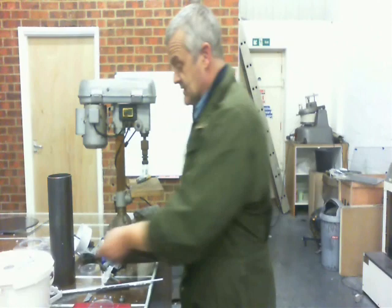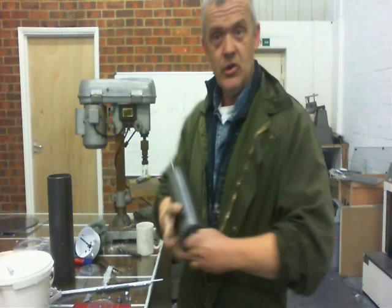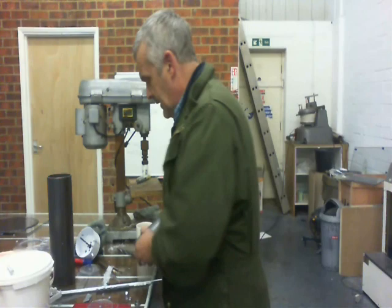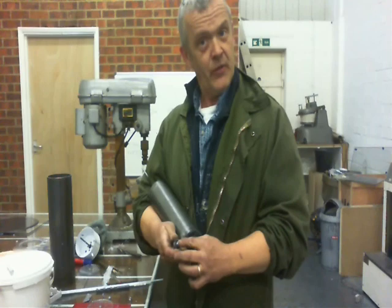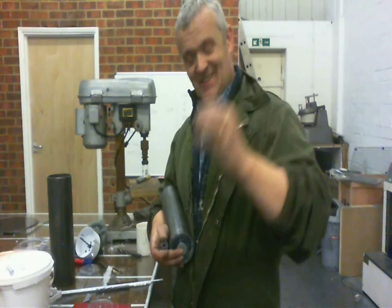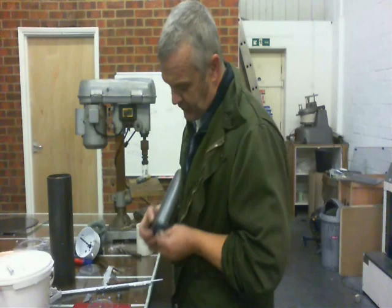I've glued the assembly with ABS glue to make sure the whole thing is sealed up. When it rotates it'll sit upright and spin on skate bearings. The problem to deal with is thrust. You could use a six-millimeter dome nut resting on the inner race of the bearing. I did something slightly different — I turned a nut down to give it a little bevel so it's eight millimeters and fits right on the bearing race. It's not ideal but it'll work as a little bearing for me.